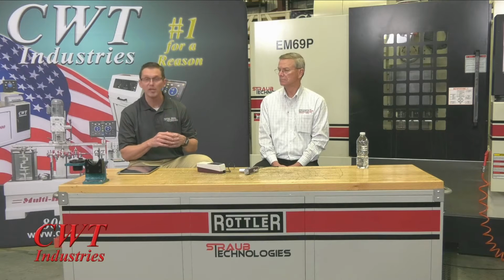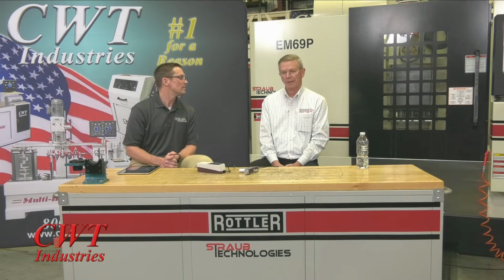The next one was, where it was, Nicosil. That's right. Is there any precautions or thoughts about using new rings in a used Nicosil plated bore? Again, you probably have better knowledge than I do about that. I've always been told that you want a very fine finish, typically in Nicosil.